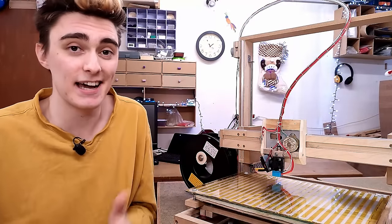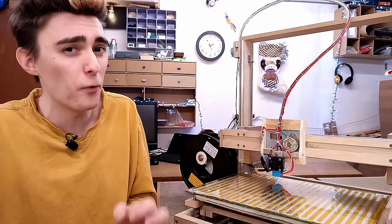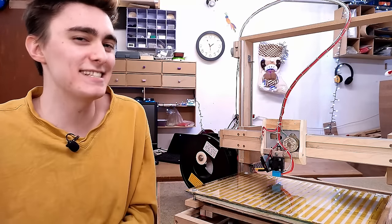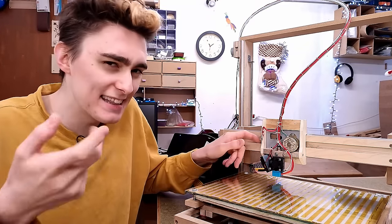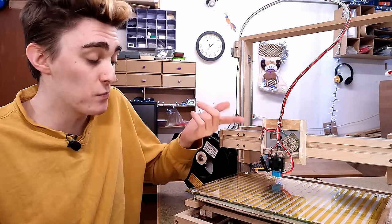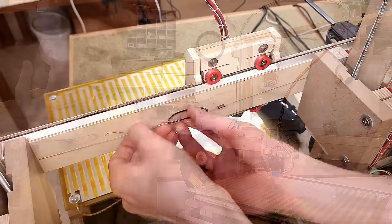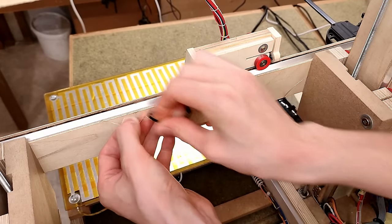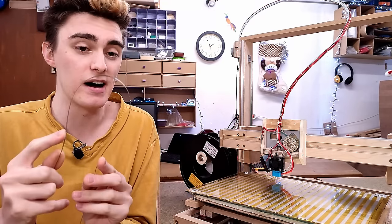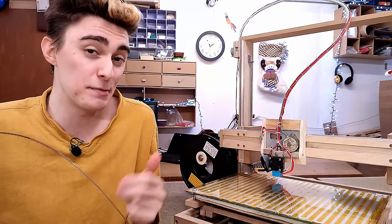Now that I've tried it, I have to say, from an economical standpoint, timing belts are probably more reliable in the long run, because cable drive isn't quite as easy as it looks. It's just that little bit finicky and high maintenance that makes it annoying. I first had my Y and then X-axis fishing line break on several occasions, not just from over-tensioning. Just like with bandsaw blades, you have to keep the minimum bending radius of the steel in mind, otherwise it'll fatigue and break, which definitely happened sooner than I expected it to.